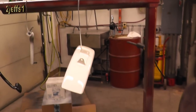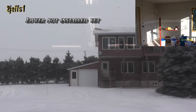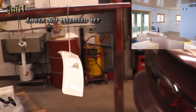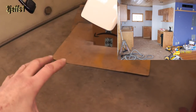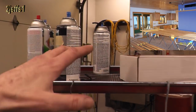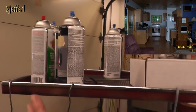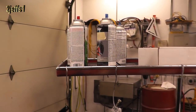Now another thing that I've used these for is when I redid the house — the kitchen cupboards. It's late at night, you don't have somebody really to help you and you want to get things done. The lower cabinets weren't in the house, so I'd set the uppers on here, have everything all marked and aligned, and you can just set your cabinet right on top of these, set it to the height you needed, and anchor it yourself without having a second hand.